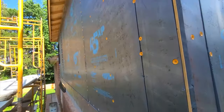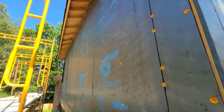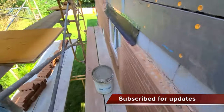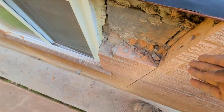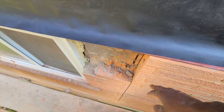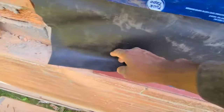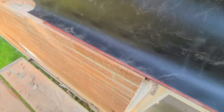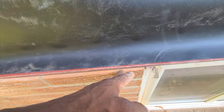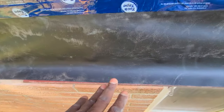Over here the bricks are going all the way up to the roof — we're just going to go right to the window there, come back around, and then go up to the roof. So we're going to extend this window here. I already made my cutout earlier. Later on we're going to cut it and install my angle line here. So if you have a four-foot window, usually you go with a four-inch bearing. Once it's more than four feet, you go with an eight-inch bearing — meaning how much angle line you hang over to sit on your bricks.